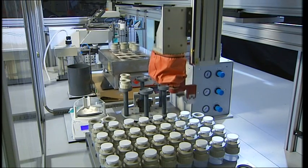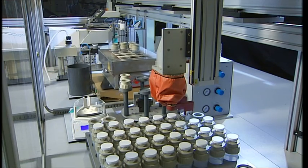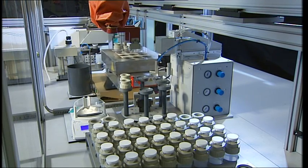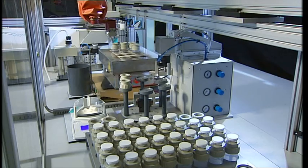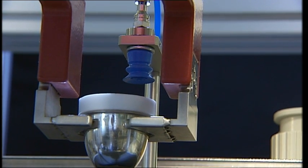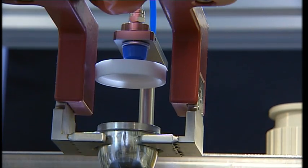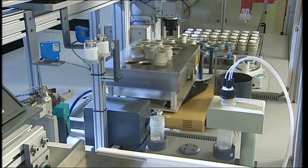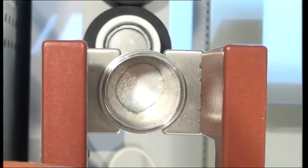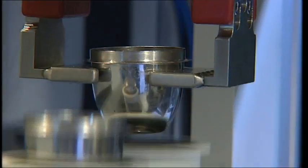At the start of the processing sequence, a three-axis robot arm picks up the platinum crucible. The plastic beaker remains temporarily in the rack. A pneumatic suction device removes the plastic cap from the crucible. The crucible is transported to the ring station, where it is provided with an adapter ring. This allows for precise fitting into the melting furnace.